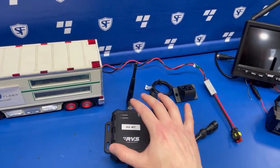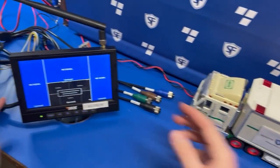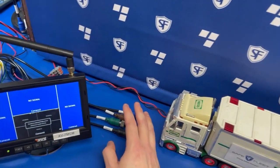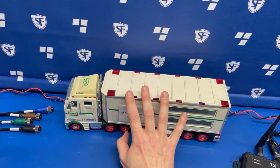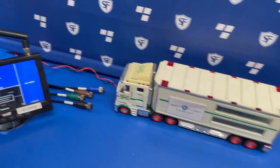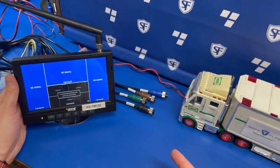And so it does this. The wireless transmitter sends a pulse over the power line, and the monitor over here is listening for that same pulse to make sure that, yes, I saw your handshake. We're definitely connected on the same wired connection, so that must mean that we are connected. Go ahead and let's meet up over a wireless channel, and we'll transmit the data wirelessly. So pairs wired, data is wireless. So that's kind of how the system is set up.